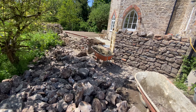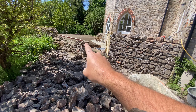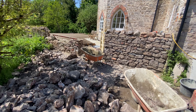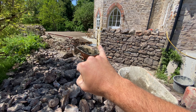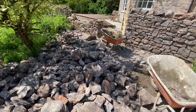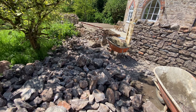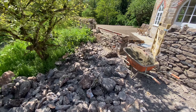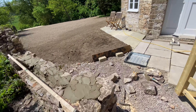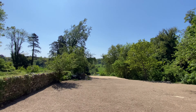I notice on this one I've dressed it up more — I've tidied the edges — whereas that other wall has a lot of new faces showing and looks slightly different. I'm going to carry on this corner with some bigger bits because it's starting to get a bit too small. There are big bits in there but they're quite thin, whereas this side is quite consistent on the ends. I'll use some of this bouldery stuff and just shape it up. We've been lucky — we've salvaged a lot of stone from collapsed walls, not just rubble dug-up stuff. A few red kites circling around — lovely to see.